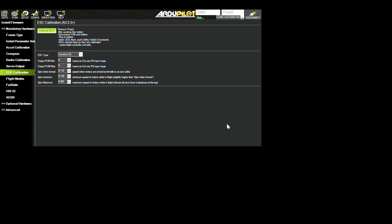We're connected here to Mission Planner on the ESC calibration tab. To calibrate the ESCs, make sure you're connected to Mission Planner and have your battery inserted. The fact that the PWM min and max outputs are set to zero means our radio should be on — and it is. We'll press that button, disconnect the USB, disconnect the battery, and plug the battery back in. In just a moment you'll hear the ESCs start beeping because they'll go into calibration mode. All right, that's it — ESCs are calibrated. We'll cycle power and see you guys out at the field for a test flight.